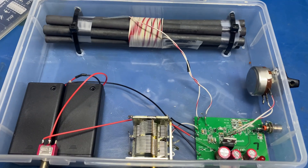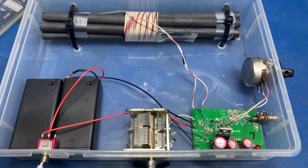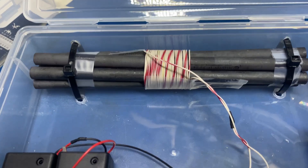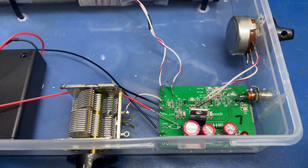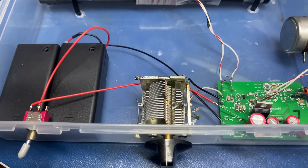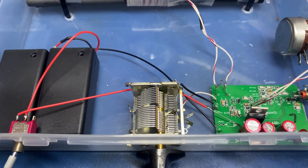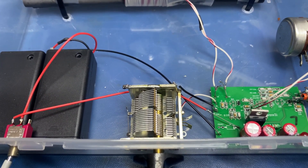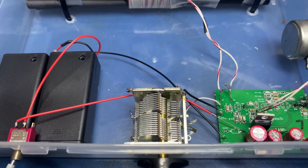This is actually the same thing I did in my clone of the DA9 antenna from a few weeks ago. There's the ferrite bar antenna, and right next to it is my preamp, only I'm tuning it with a tuning capacitor. That tells me I could do the same thing as C-crane if I were to varactor diode tune this and supply a voltage over a cable from a remote tuning unit.